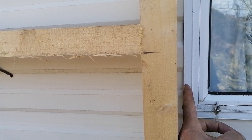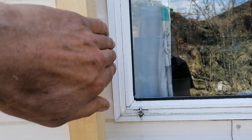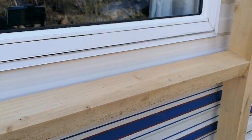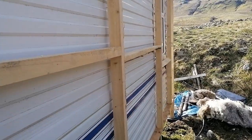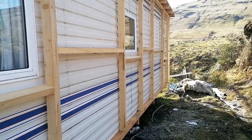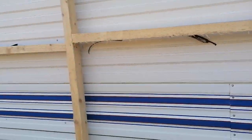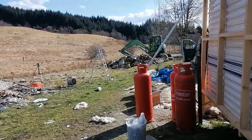Around the windows I've set the frame back from the window edge about three quarters of an inch, and that's going to be the thickness of some cladding that will go in there to frame the window all the way around. There'll be a piece of cladding on the bottom like a sill, and the water will run off — that's why all those are angled down. All this timber is fortunately from Otter Ferry, from my mate Jock who's got a sawmill. I've been working over there on Mondays helping him fell trees and clad agricultural buildings, and in return I get timber — so I've got a free source of timber which is just fantastic.